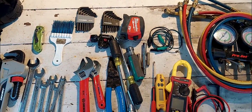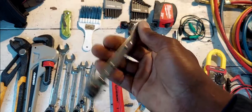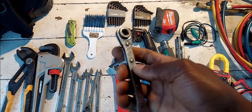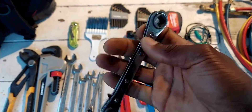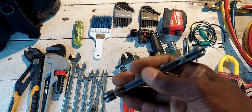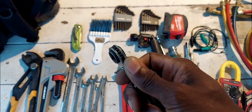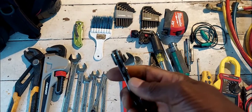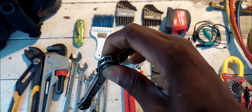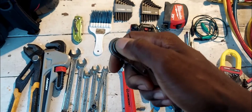This right here is a must-have — it's a service wrench. You can get one for about $15. You'll use this to open your B-tank and your oxy-acetylene tanks, and to operate service valves — suction service valves and discharge service valves — on your system. You can also use it to remove the square lock nuts on condenser fan propellers, blower wheels, and scroll cage lock screws. It's perfect for that.